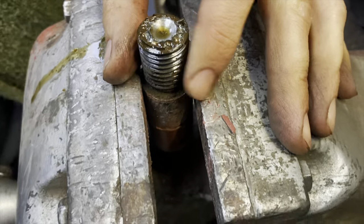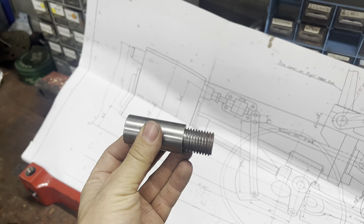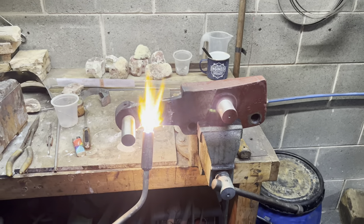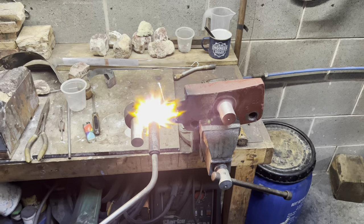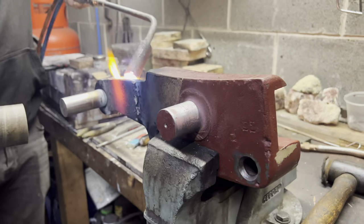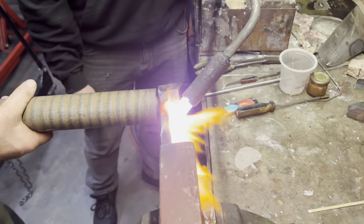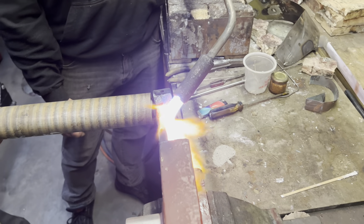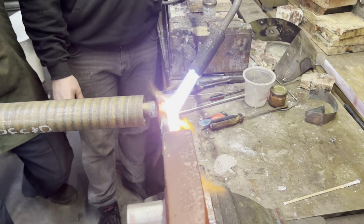A nice clean thread — a little bit hot there because it's obviously been work-heated. The old pin and the new pin before it went in — all sorted. One of the expansion links was actually slightly bent when we looked at it, so this is heating up the slight bend to create warmth in it so that we could just fractionally twist it back to being square again. It was only about half a mil out — just a little tweak while it was hot that allowed us to bring the two faces back into square before we started machining on the milling machine.